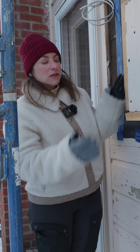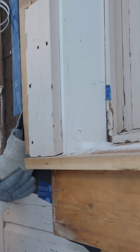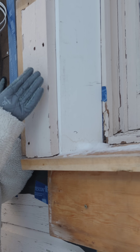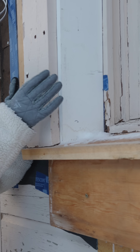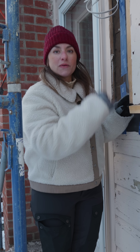That means that once we have that much thicker exterior wall system, we're also going to have to build out essentially a box system for our windows in order to accommodate for that much thicker envelope, and then we'll do a bit of trim around.